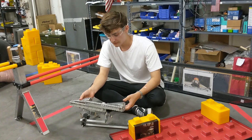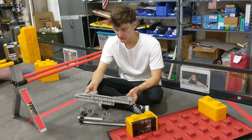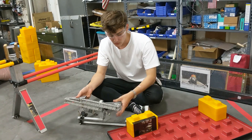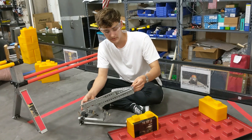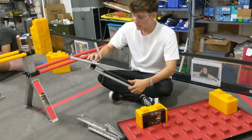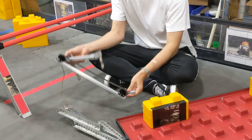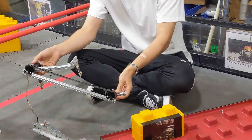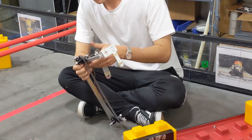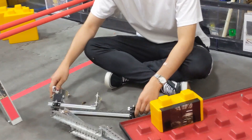But we didn't end up going with that design, first of all because it's a little bulky, and also it doesn't have the full degrees of freedom — it only has about 180 degrees, and we need a little bit more than that. Otherwise we really can't go low enough from our delivery system and we'd have to drop it from above. So we ended up going with the chain bar linkage, which starts inside the robot and can actually go a full 360 degrees. We're just using about half of that, able to go low enough for the first layer and continually build upon that. This is a lot better for the task at hand, so that's why we went with the chain bar linkage.